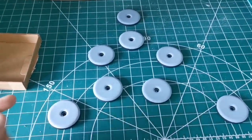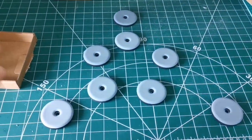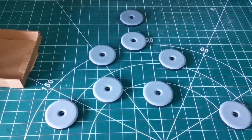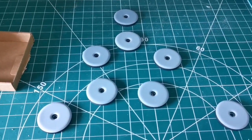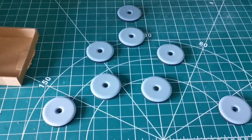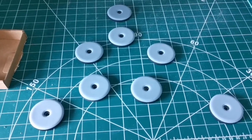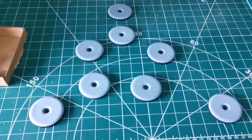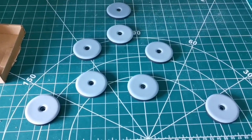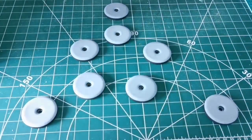This will be on the base of the rocker carriage where the telescope will be placed. For the base, they said you have to put something with a little texture. Some suggest formica, but I think the best thing is to use something integral to it that doesn't need sticking or come off. So I think Hammerite paint, I have a spray of it. When you spray it on the surface and it dries, it creates a hammered textured surface. And I will use that.